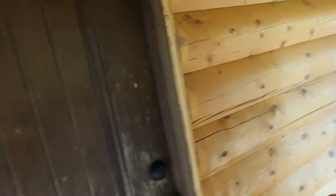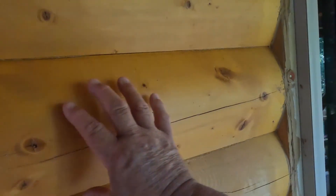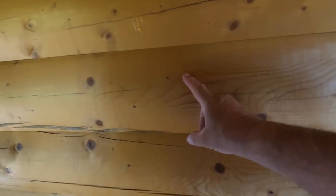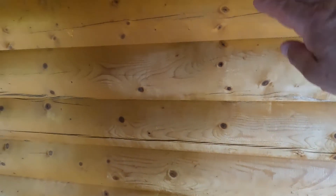The whole wall will be done, and then we'll go ahead and put on a coat or two of stain. This wall looks good here but needs stain in some spots. Where some stain came off I'll lightly put a little bit on a rag and wipe it down. The stain comes off real easy, then all of a sudden it looks good. We'll do one coat all the way through, then a second light coat since there's no clear left on here — it's all gone — so it kind of blends in.